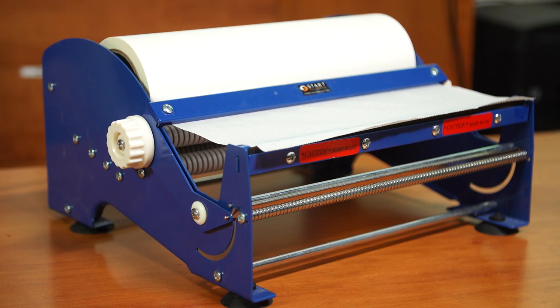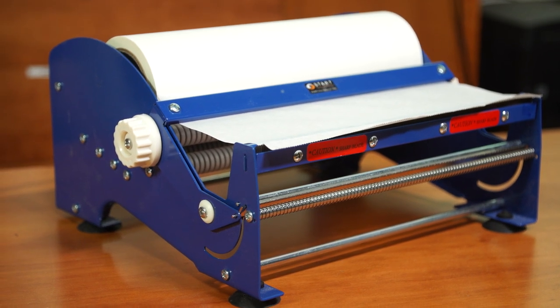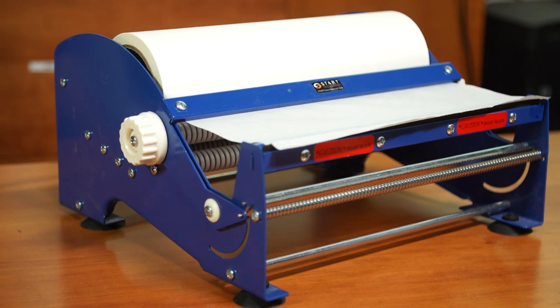Now, you could do masking tape, painter's tape or whatever, but for something this big, a lot of the times the adhesive is a little too aggressive, especially after you melt it in a laser and it really sticks. So we have transfer paper, our transfer tape, which is typically used in sign making. If you feel it, it's a much lower tack than masking tape.